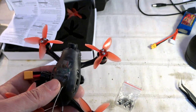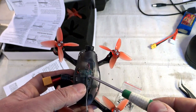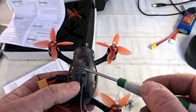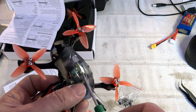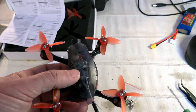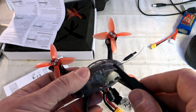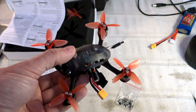More, when I received it, as you can see here on the top, we can see the FrSky receiver, and here on the small white part, this is a bind button. When I received it, this receiver was completely shifted to the right, and it was impossible, whatever the tip you wanted to use, to access it without removing the canopy. So what I did, I removed it and shifted it a little bit to access the bind button much more easily from an external side. So now I can click on it without removing everything.